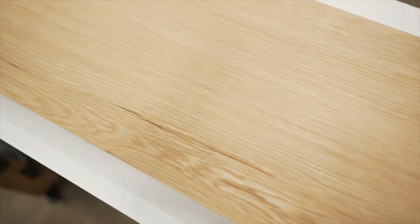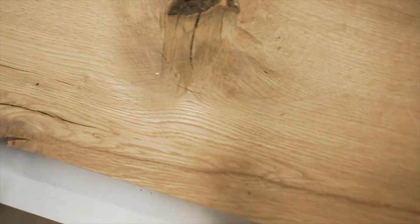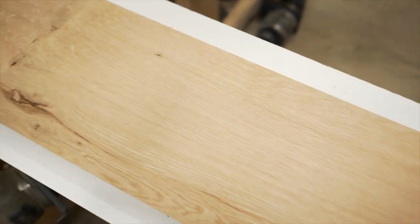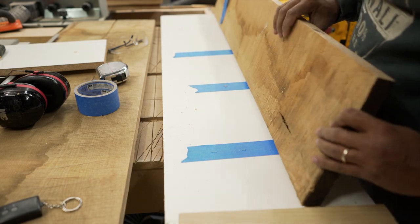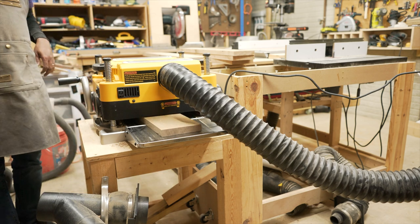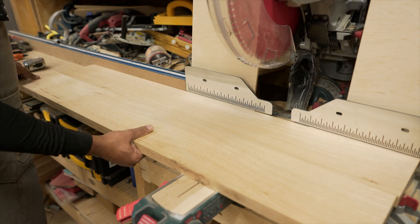After a few passes it looks in decent shape — not perfectly jointed but straight enough to plane the other side. Once the other side is cleaned up I make a final pass to make sure I get this side clean as well. Here I'm making the final passes; I cut off a section to get rid of a bad knot. And that's how they come together seamlessly to make a big panel.